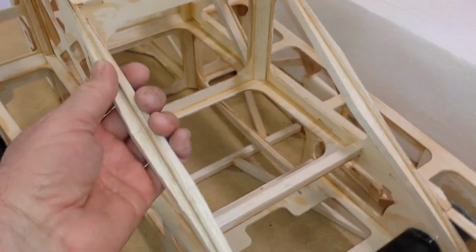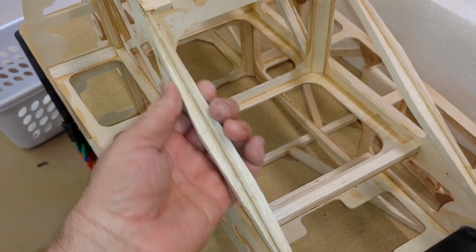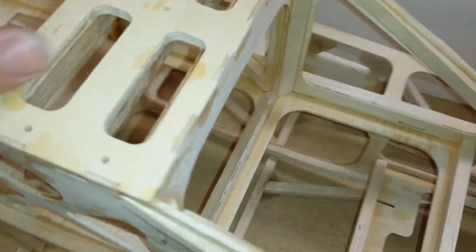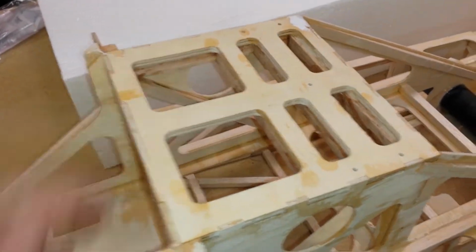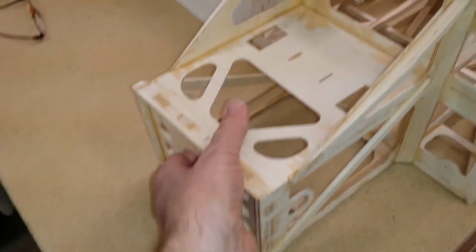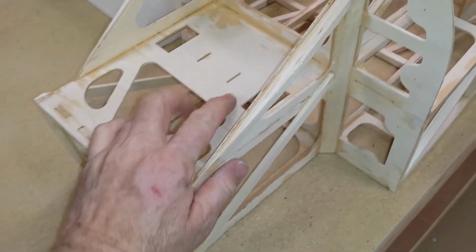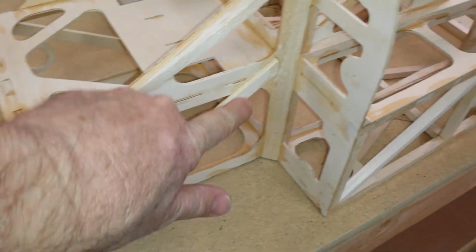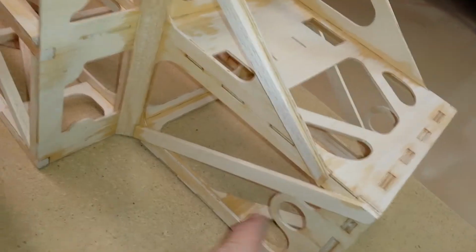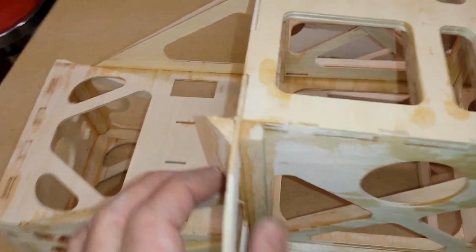After talking to Terry Wiles, who's done one of these and who's built his own, the Viper plane, who's next level ahead of me on building, he suggested I put in balsa bones on both sides. I beefed up the landing gear with some extra oak plywood rails in there as well. And then the motor box, I was a little concerned because it had just a little bit of twist, and I didn't want to shake this plane apart with that twist, so I've put a piece here going this way, piece here going this way on it, and I've doubled the support going down here on the firewall too.